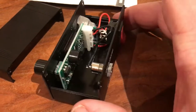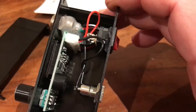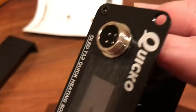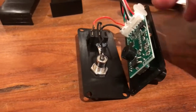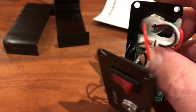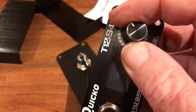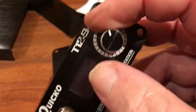The case is aluminium. I've just removed screws from the four top corners and lifted the top clamshell case off. Internally there's a small circuit board at the front, power switch and a DC jack at the rear, and the soldering iron connection at the far end with a bit of hot glue around it. With both parts of the case removed you can see the hot glue at this end that secures the nut on the soldering port — it's also spilled across both connectors holding them in place. The control knob on the front is a clicky encoder rather than just a potentiometer, and it clicks in and out for setting the menu functions.